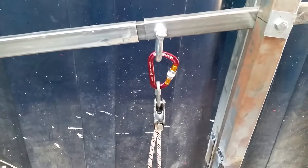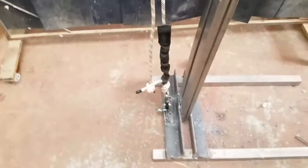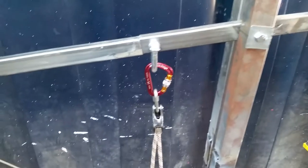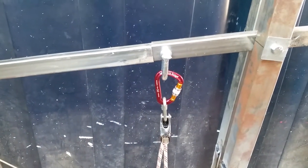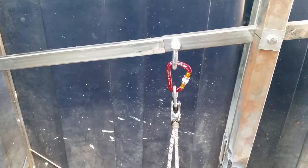Something like that is perfectly fine for this kind of weight, even at three to one — which it roughly is: one, two, three out to there — it's still well within the loading capabilities of this equipment. I'm now going to make a sliding handle so I can get better leverage by being further back to make it easier or lift something slightly heavier. What I could also do is put a puller in between the shackle at the bottom and the shackle there — it's three to one against the puller, but I'm only talking about lifting a couple hundred kilos, so there'd be 600 kilos of pull to lift 200 kilos.